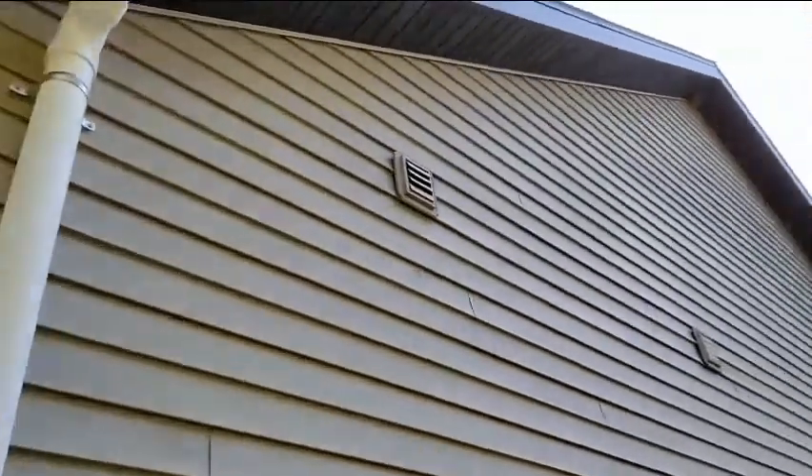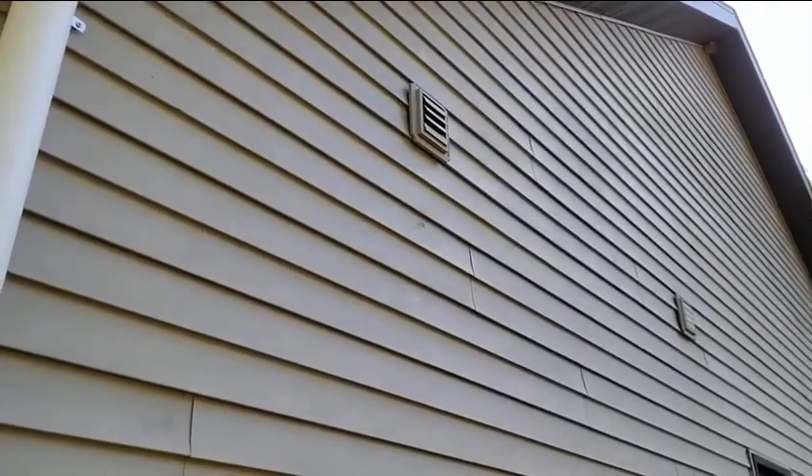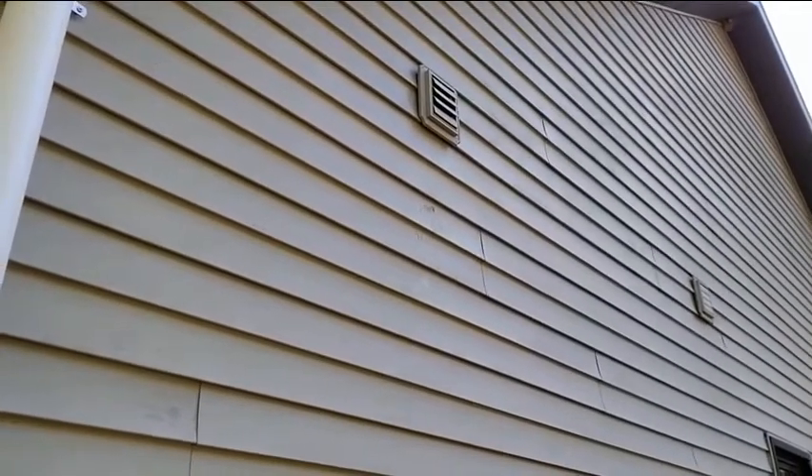So we're moving some air out. The next thing we want to do is make sure this air is going outside of the building. I left the bath fan running inside while I came outside to look for the termination, and I found it out here on the gable end of the house. Taking a close look, you can see the damper flaps are moving a little bit and they're open, so we've got air moving through that vent to the outside — that's a good sign.